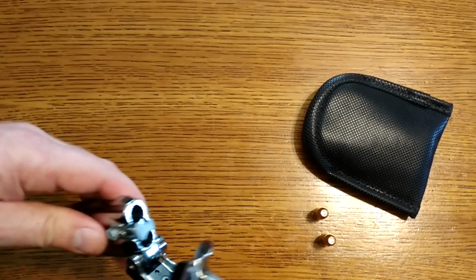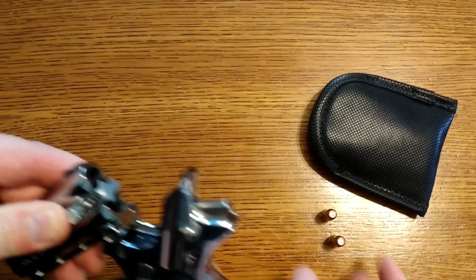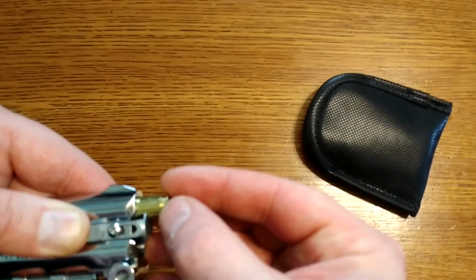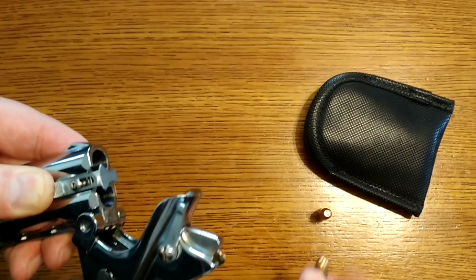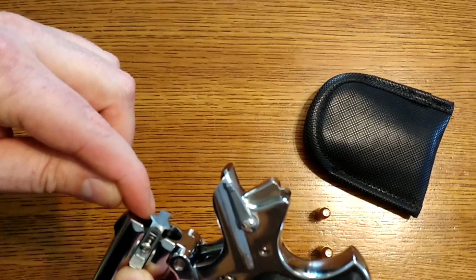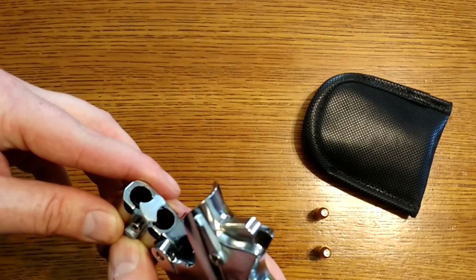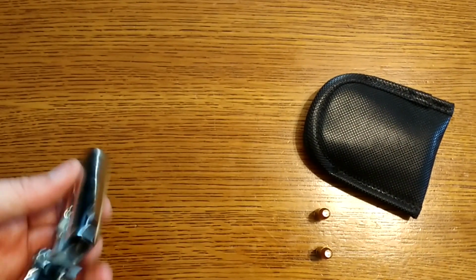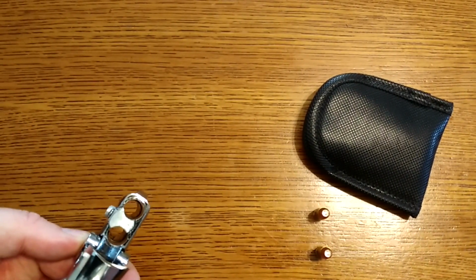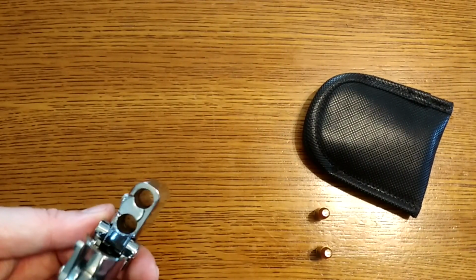First thing I did was on your ejector here. The rounds going in, you have to put them in at an angle, so it was rubbing really hard and it was really hard to get them in. So what I did was I came in at an angle here and removed the bottom half and put a slight angle so that they would slide in with no resistance. Second, I polished the chambers out with my Dremel and some Flitz, also deburring the rough edges around the chamber.